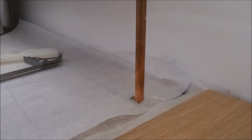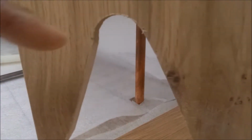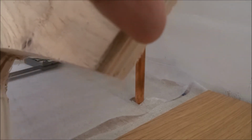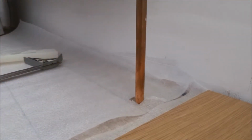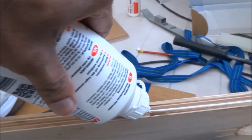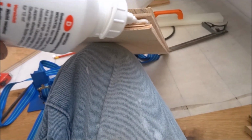So hang on. So I've cut the slight notch that was on the wood off with the multi-cutter. So I drilled into there, 32mm drill bit, used a jigsaw to cut these bits out, and a multi-cutter for these bits. Also I've cut it off the end of that as well. So let's glue it on. Let me apply the glue, hang on. Okay, glue in this notch here.